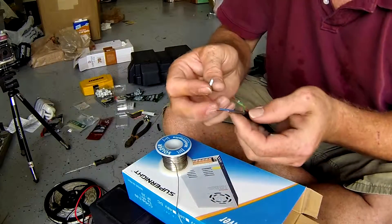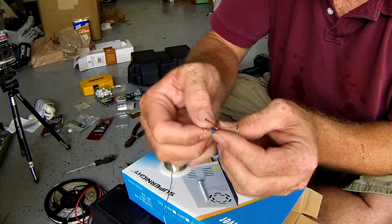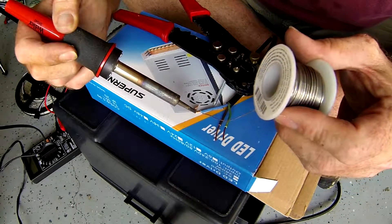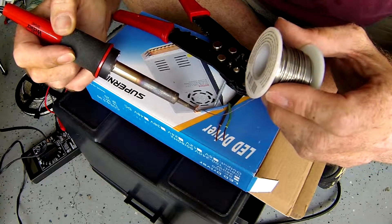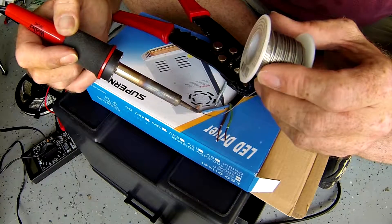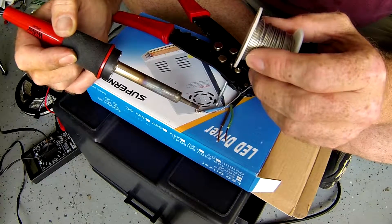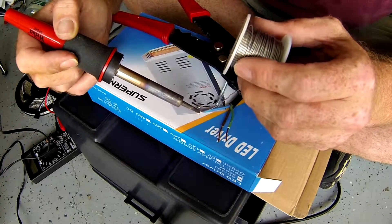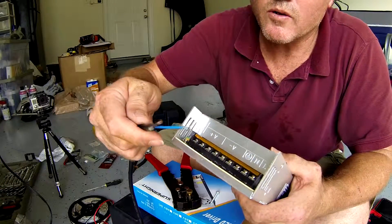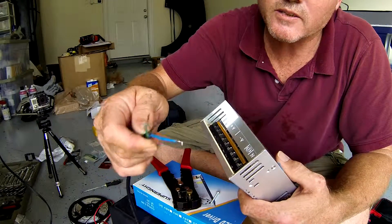So that is your common — brown is common, which goes to the terminals marked with little lines. Brown wire will go right there. What I like to do when making these connections is tin the end of my wires, wrap it around a screw, and tin it — that gives you a really good, decent connection. I don't like to use splices. I wrap the wire, put a little loop on it, get my solder and iron, and tin the surface. The solder soaks into the wire and it won't come apart. Now I've got a nice good little loop — when I screw it down it'll be secured and not going to come off.